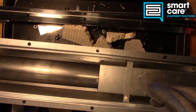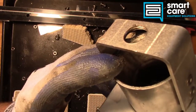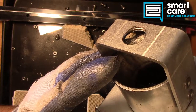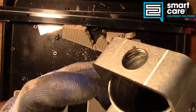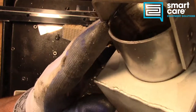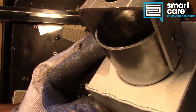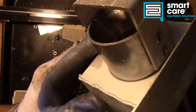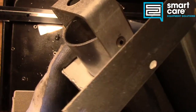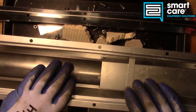You can also run into trouble with grease in the venturi. This long venturi tube is drawing air in from around the equipment. If this is mounted above a grill that cooks very greasy items like bacon or hamburger, that grease-laden air coming off the grill will get pulled in as this unit runs, and it will coat the inside of this tube with grease. As that happens, we choke down, we lose air flow, and the burner stops operating correctly — it no longer has the correct mixture of gas and air to combust correctly. You can try to clean the venturi out, but realistically you're probably going to have to replace the burner at that point, because that grease will eventually get into the burner assembly and at that point you're pretty much done.